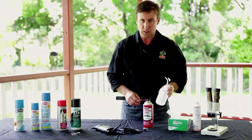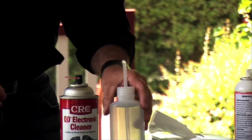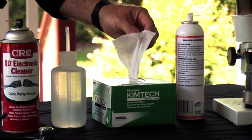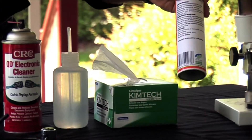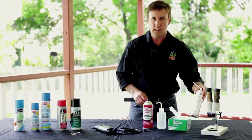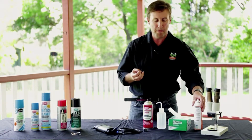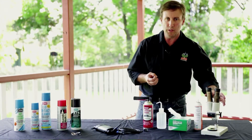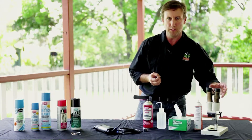After using the electronic contact cleaner, we flush the well with distilled water. We then use a kim wipe to remove the excess water from the chamber, and then a can of compressed air to blow any microscopic molecules of water from the chamber. Finally, we'll use the microscope to check visually that we have a clean chamber once we're finished.